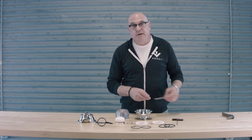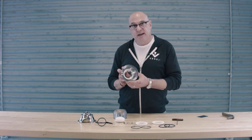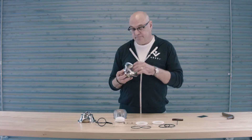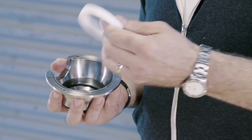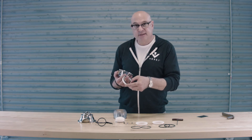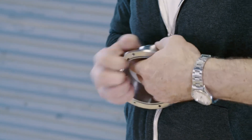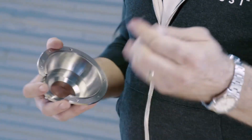Now that the piston is removed from inside the ball assembly, the remaining step is to remove the ball seats from inside the stainless steel half-spheres. Use some pressure and pry with your fingernails, slowly pushing out until it comes out. Notice there is also a gasket that rides in here — this is how that gasket would normally ride inside that groove. Set that aside and repeat the process for the other half of the sphere assembly, including the second ball seat and gasket.